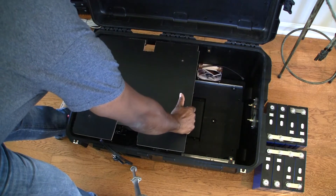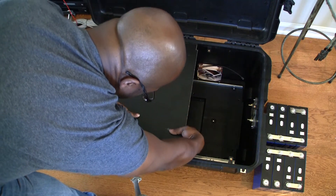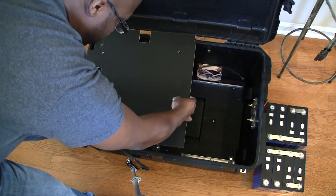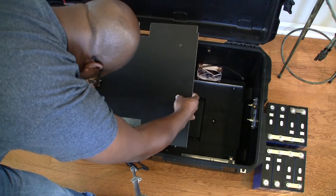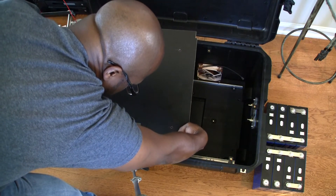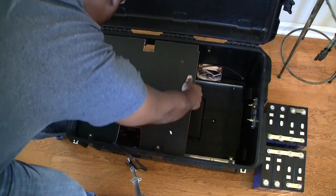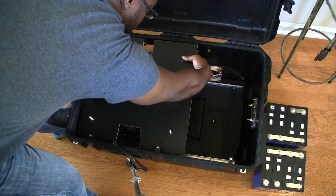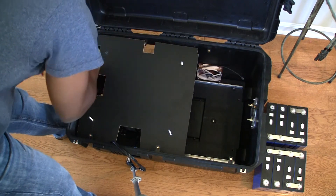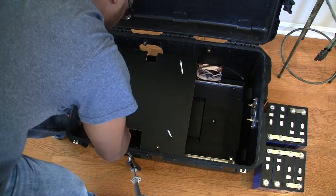This piece of board I'm trying to fit right now is chalkboard — you can get it from any hardware store. It's about three-sixteenths of an inch thick. I thought it would serve the purpose, but it was just a little bit too flimsy. Also, taking it in and out of the case it would rub against the threads on the side and start leaving fibers down inside the bottom. Because I took it down to just one additional level, I was able to make new standoffs to raise up this tray, and with the new material I didn't have to cut as many holes in the top, side, and bottom to accommodate the lights, the AC input, and the solar charge controller input on the back of the case.